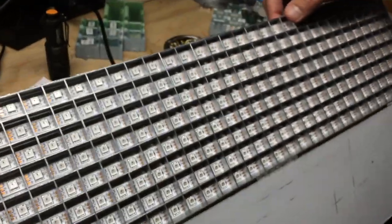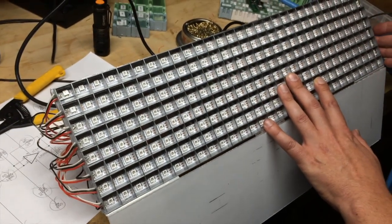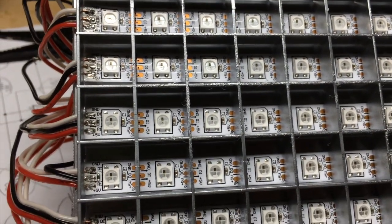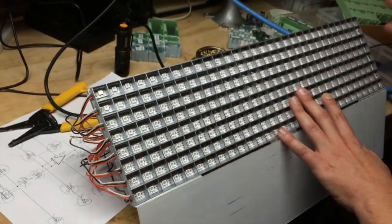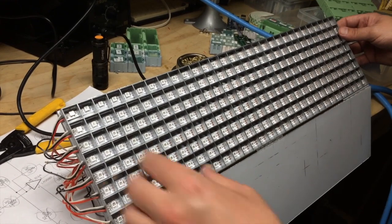Oh, that's good. So I used the 60 LEDs per meter strips and cut them in half-meter lengths, so that we have that series resistor as the first pixel. Oh yeah, these strips come with a series resistor? Yeah, I see it. That way I don't have to worry about putting the series resistor in my wiring in the back. And then with a 4-meter roll, you can get an 8 by 30 array. Yeah, it's huge. That's like 240. Yeah, it's about that.